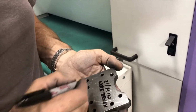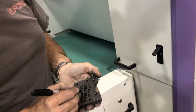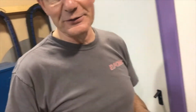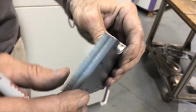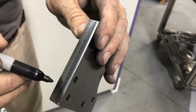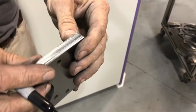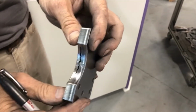And then of course on the back side we had a regular sanding block. But that is not a practical application because as they wear in and come to different lengths, you cannot do that. Okay, and here I'll give you a view again of the edges. We removed quite a bit of oxide, but not all of it. And that is not necessary. Especially in this area here, where you are in that dip of that step, you sometimes cannot cleanly remove it. Here again we have a lot, and here we have less, especially here in the rounding. But even that would paint fine with paint adhesive.